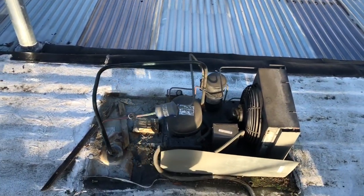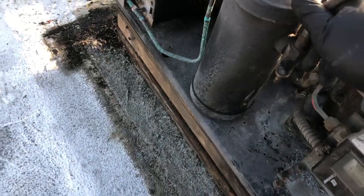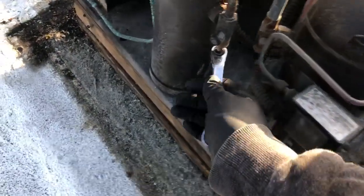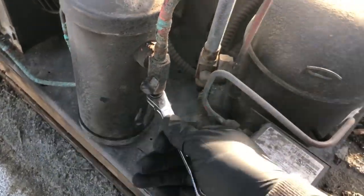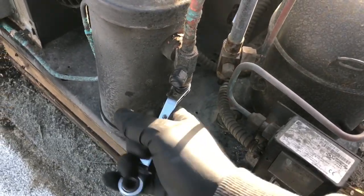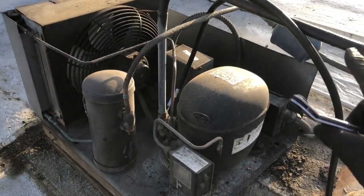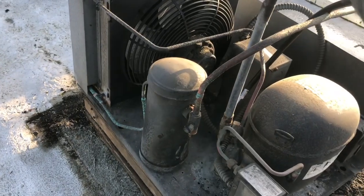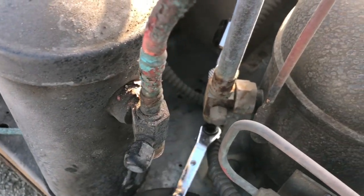Let's gauge up on it and I'll show you this real quick. So let's gauge up on the low side, and we're going to close our liquid line service valve — it's good to get two wrenches on there, see how the whole thing wants to move. Get gauged up on the low side, close off your liquid line, get that all the way front seated. Then we'll go bang the thermostat on, and all the refrigerant is going to pump back down into the receiver and the condenser.